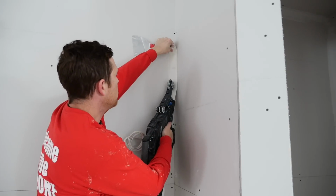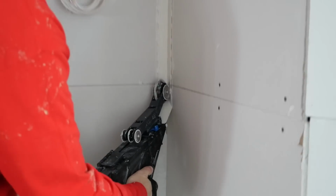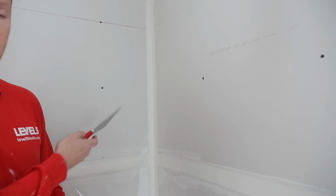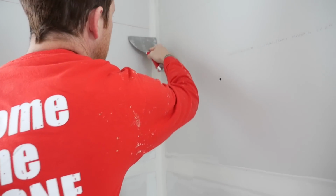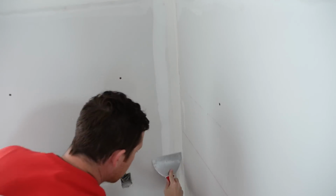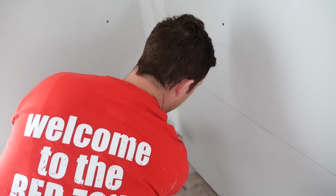So even though this is the new creaseless FibaFuse, you can still see that it forms to the corner very well, and being creaseless, it's much stronger. So typically when taping with automatic taping tools or even the banjo, we would recommend rolling and flushing your corner, but being creaseless, we found you actually can use your knife to wipe it, and it doesn't actually tear the corner. And this used to be the main concern with FibaFuse, was that you couldn't tape angles.